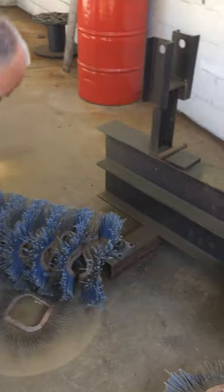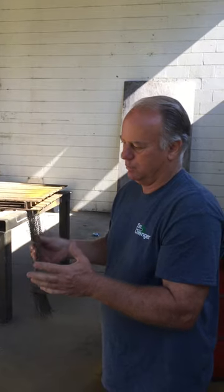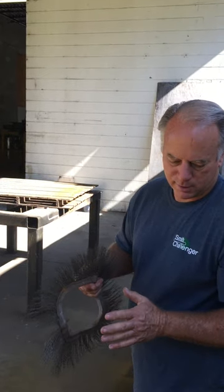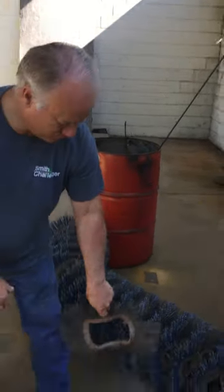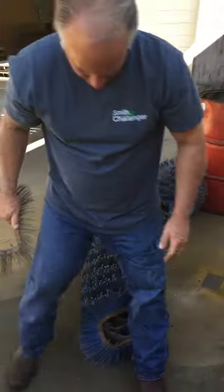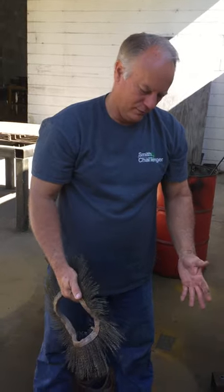Tap the plate that has the idle bearing attached to it off of the shaft. It may be easier to remove the plate on the end of the core that physically holds the brush wafers in place. With the bearing and plate removed, the brush wafers should come off the core. If they're stuck, tap them with the hammer to loosen them. You can also have one person straddle and hold the wafers while another pulls the core out — that's the fastest way.